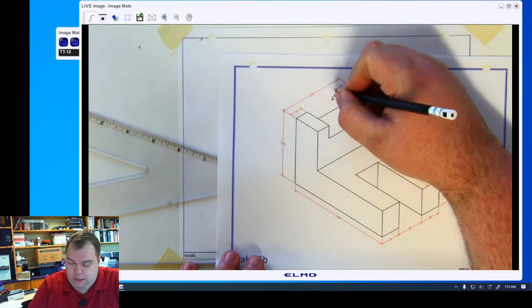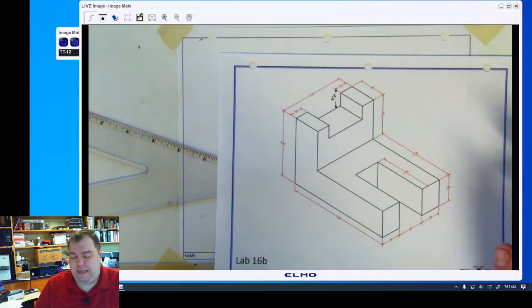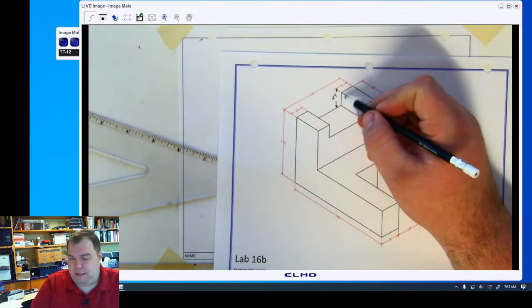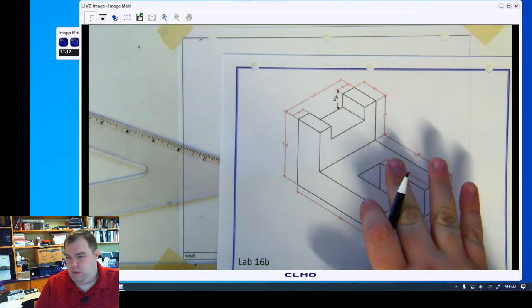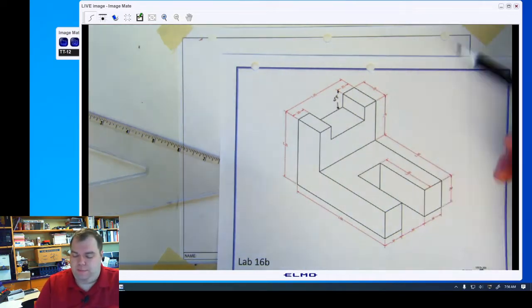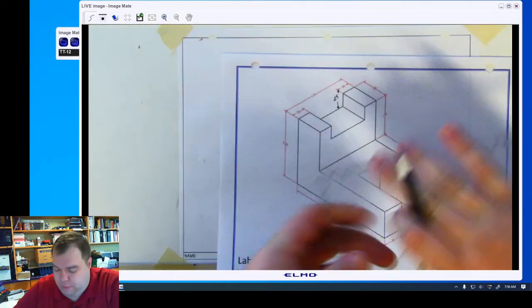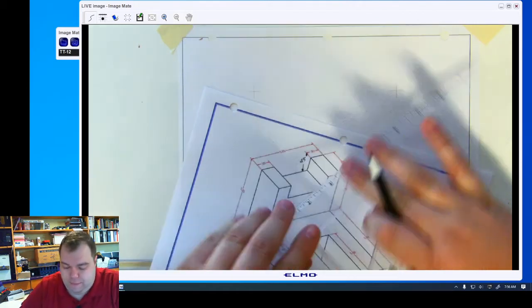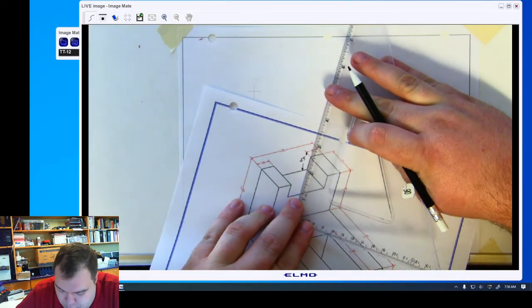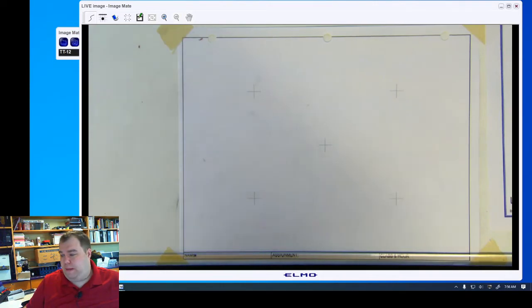While not usually the accepted way to do it, you can judge that size based on it being visually similar to the same size as the quarter here, or you can measure it, because while this is not the actual size of the shape or the dimensions that it's telling you, it is proportional, or at least it is to scale to itself. So if I measure it on the paper, it comes up like 1/2 of an inch. And I measure it there, it's also 1/2 of an inch going vertical. So it's an easy way if you are missing a dimension, although you shouldn't be missing dimensions. That was a mistake on my part.